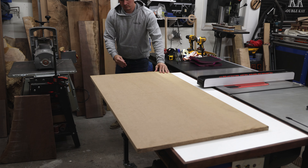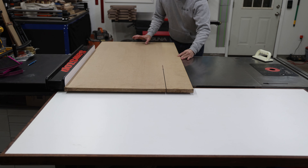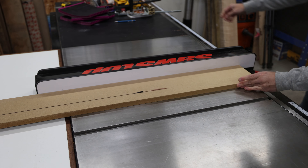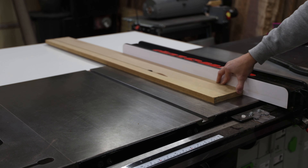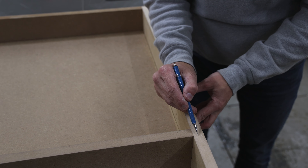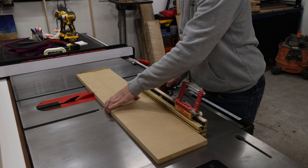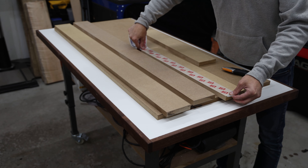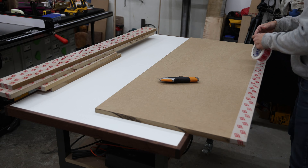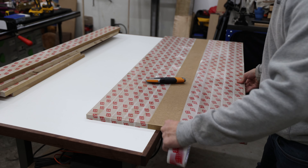If you've seen any epoxy builds in the past, you're likely familiar with this mold building process. I'm not going to claim the method I show here is the best, but I will say this technique is essentially foolproof and leak proof. I've been pouring epoxy for about two and a half years now and have yet to have a leak from a mold. When most people make their molds, they use melamine and cover it with an anti-stick agent like a mold release spray. I've used melamine in the past, but I've found that MDF is more reusable long-term as the screw holes aren't as likely to strip out. I've heard stories about excess spray getting onto wood pieces and compromising the epoxy bond, or when not properly applied, the sheet of melamine sticks to the entire piece and has to be chiseled off. So I opt to use MDF and cover it with packaging tape or sheathing tape.